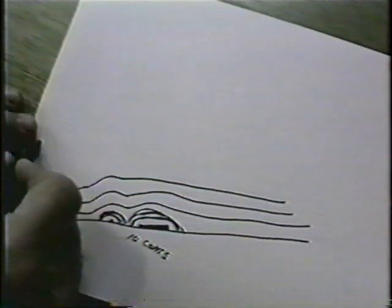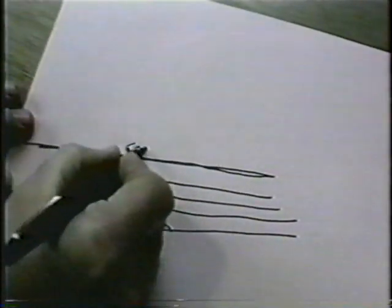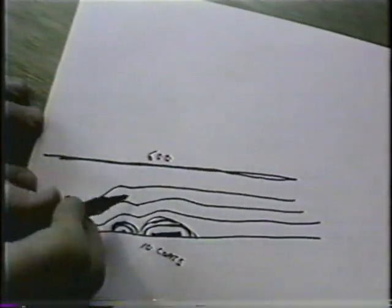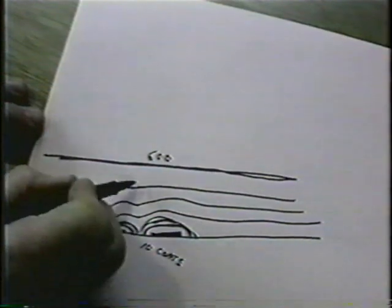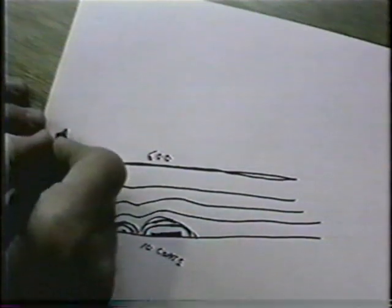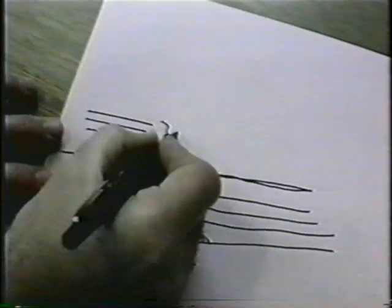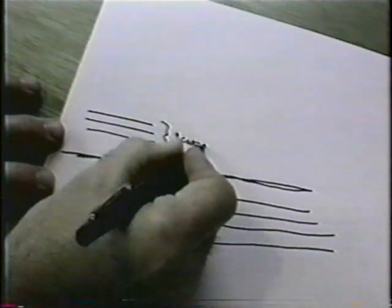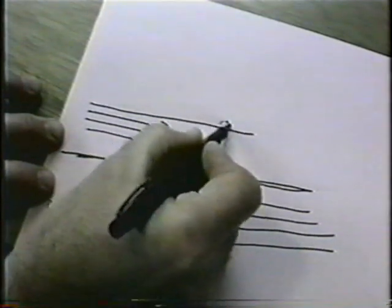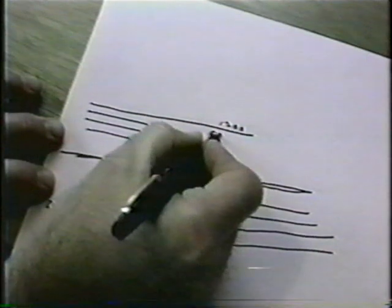Then I would block sand this dead flat, sand it by hand or block sand it with 600 sandpaper and try to get it back to being flat. If you go through any spots, of course you can still touch it up. It's not a problem. And then I would put on 3 more coats of clear. This would then get sanded with 1200 paper and buffed with Gorham Silver Polish.